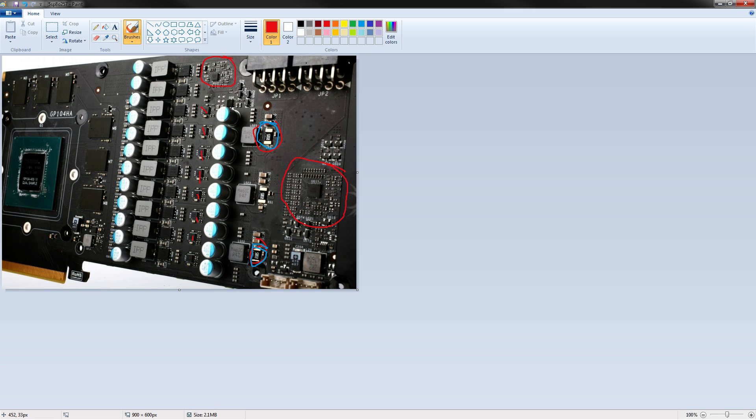So that would be 50 amps low side, 25 amps high side. There's 8 of them, so that gives you 8 times 50 — 400 amps core. This here will be your core voltage at 400 amps, and this is going to be your memory at 100 amps. Plenty of power for air cooling and water cooling. Colorful doesn't really care for liquid nitrogen, so I'm not surprised that we're not seeing something more insane, because they have built some insane VRMs in the past.